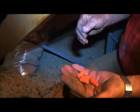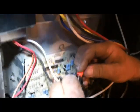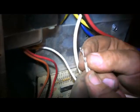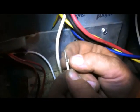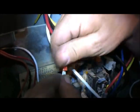We're going to need four wire nuts. We always use baby oranges — they're very universal; you can use them for fan motors and also for low voltage. Now for the wire nut technique: take your two wires and get the ends lined up — that's very critical. If one end is off it won't make a good connection. Leave the wires untwisted, place the wire nut on top, and twist it on while holding the wires so neither one slides up or down.